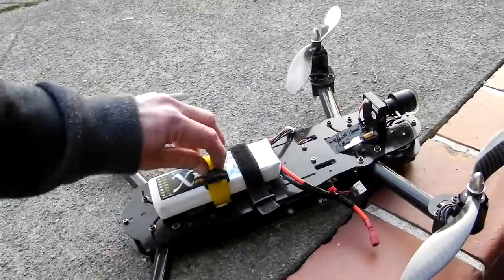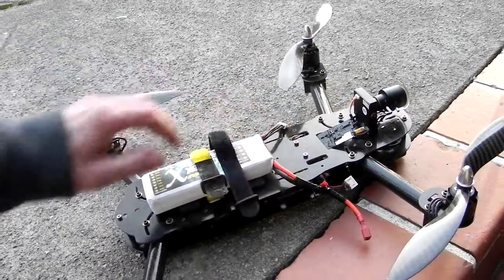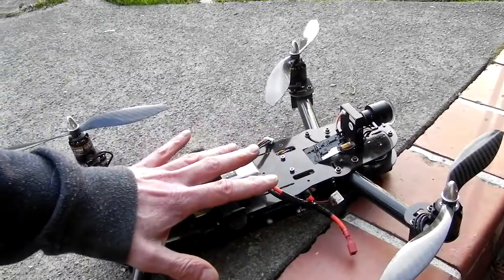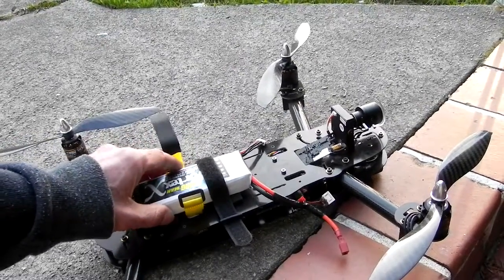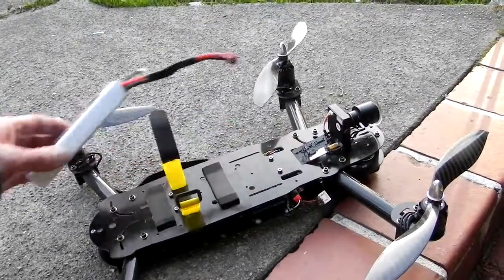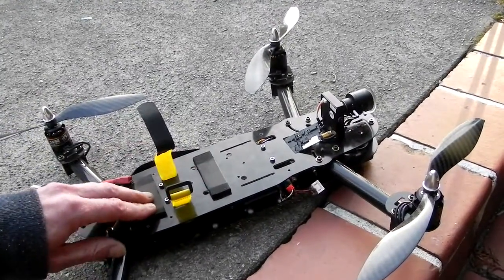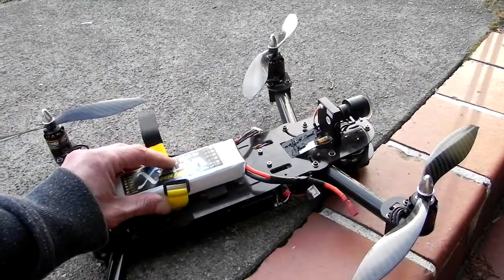I have underneath this, which you'd notice, these hex or socket caps stand proud above the top of the frame. That might have been an issue for mounting your batteries, you might think, on the top at least. But as with the top and bottom, I'll be supplying an adhesive-backed 1/4 inch high density neoprene foam, and then your battery will sit right on top of that foam.